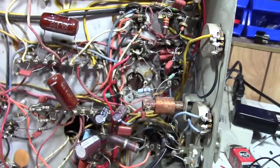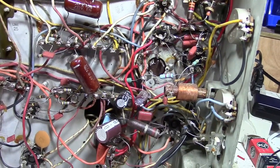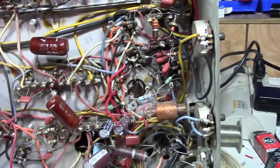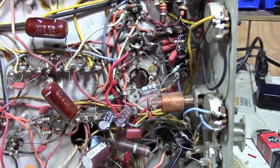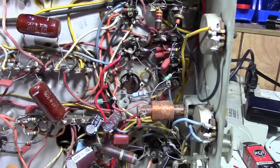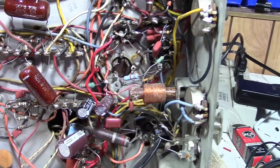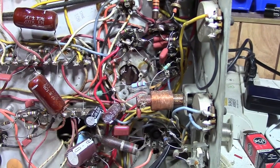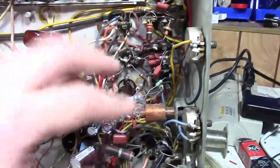So I do have one bit of advice too when you're working on pretty much any vintage tube-based TV. If you're gonna put any time, effort, and money into it, first thing, horizontal. May be a pain, may take a while, but I recommend pretty much replace everything if you can, including the carbon comp, because if you use stable parts, silver mica, metal oxide resistors, stuff that's very temperature stable, you can avoid a lot of issues down the road with having to tweak it and adjust it as the set warms up and so on. Or, you know, parts in here get kind of stressed too.